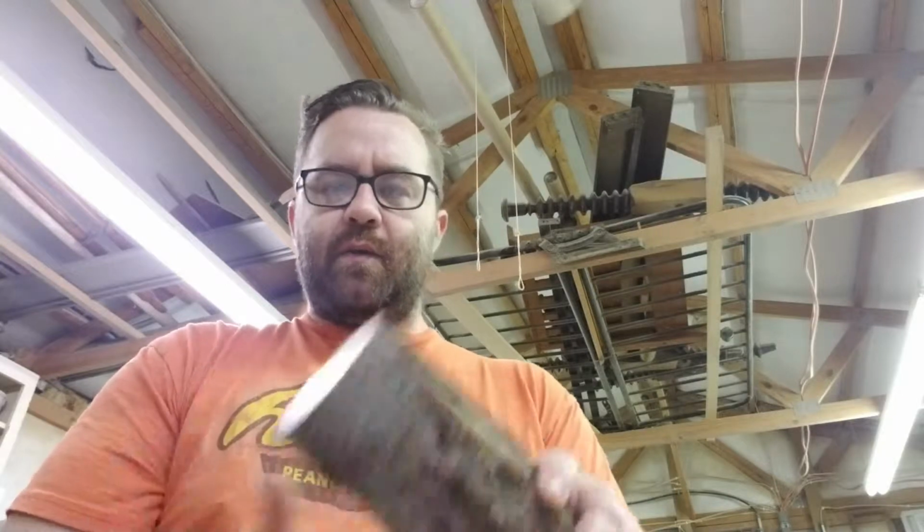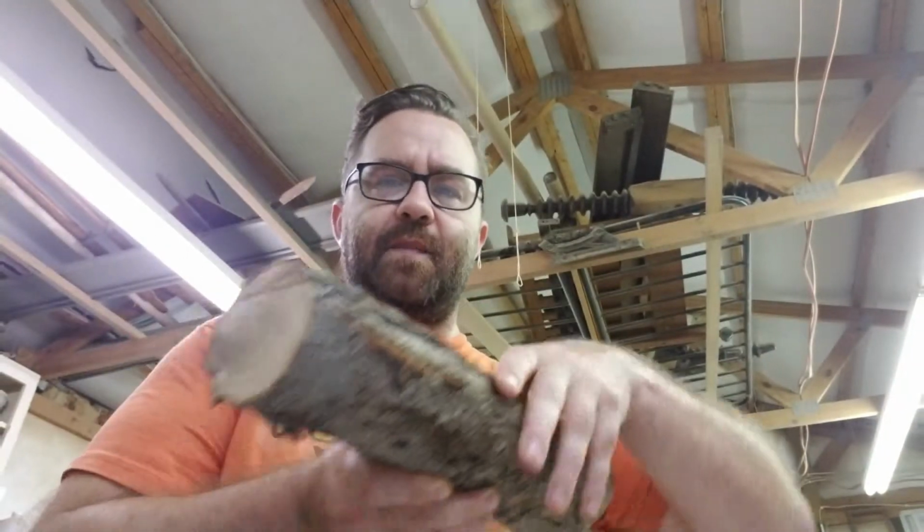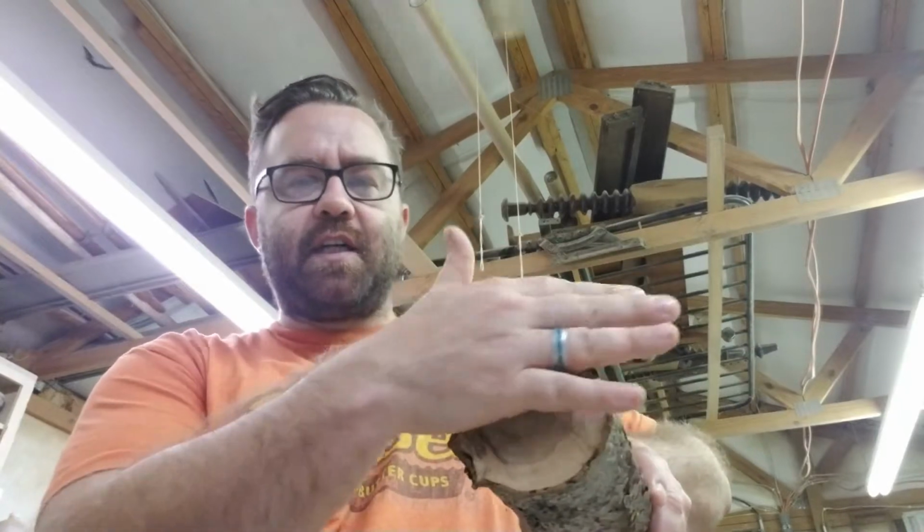And what I'm also going to do, and I'll show too, is take a piece of scrap wood that's just flat and straight, probably a random piece of plywood that's over here, used from other projects. We save all the scrap stuff for whatever. I'm going to put the piece of plywood on here and put a couple screws, probably farther back away from where I'm going to be cutting. What that's going to do is give me a flat surface up against the fence of the radial arm saw.